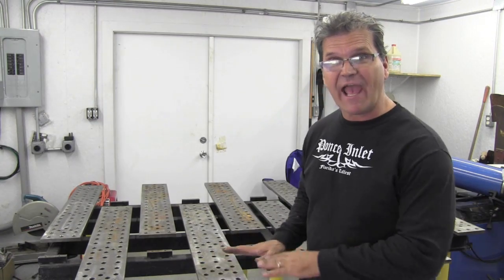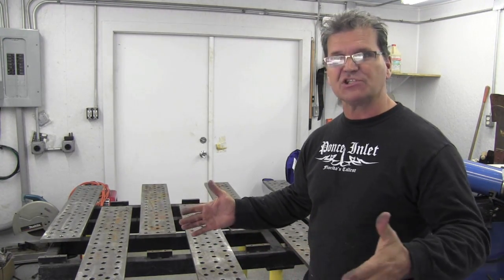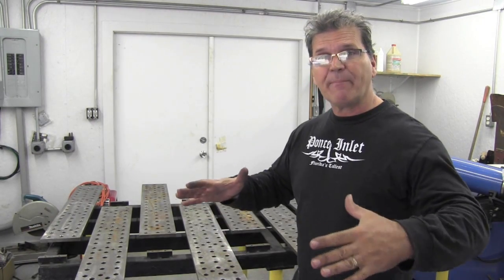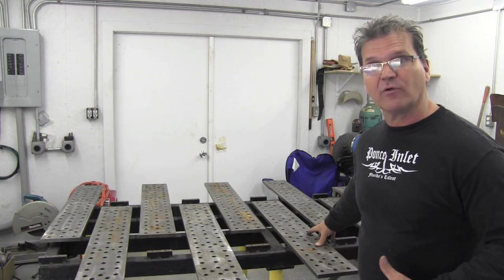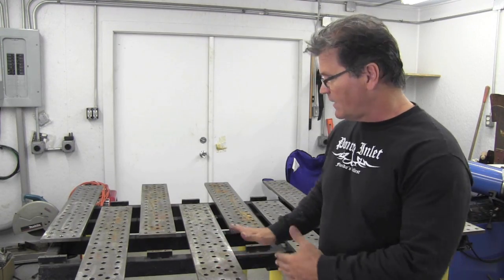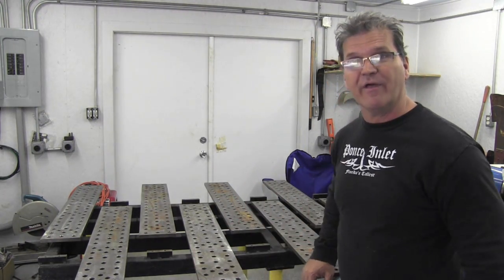You can see I've got the slats staggered to extend the work area. The top of the funnel — it's just a sheet metal funnel — I'm using 18 gauge cold roll today. The top, the big side of the funnel, is 56 inches. In order to get a big enough work area to put stops and clamps and fabricate that really easily, I just took them all loose and staggered them, and that gives me a way to do that.